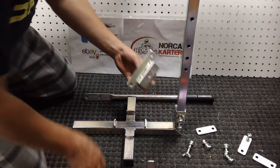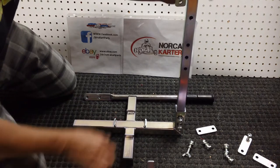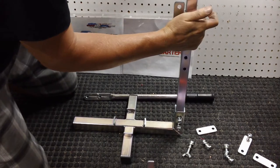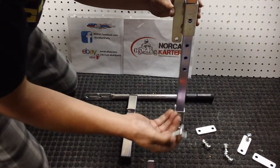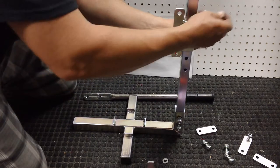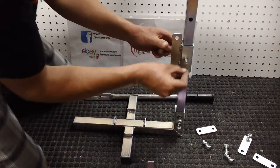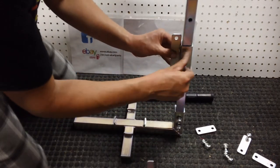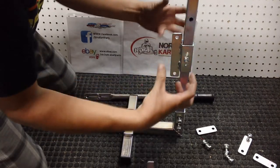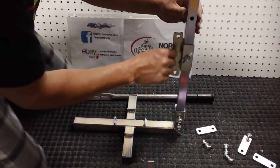Next — I don't really know what to call this, so I'm going to call it the lever bar sliding adjuster support. This is going to slide over the top — you've got to go over the plastic cap there. There's a bolt with a wing nut, and that bolt has two washers. I'll put it in the middle since I'm not sure exactly what position I'll use. Wing nut goes on. Again, this just needs to be snug — finger snug — so it's not going up and down, but you're not going to over-crimp anything.